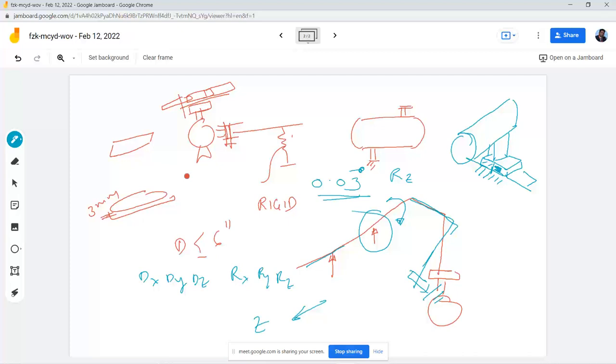In such cases, when you have this kind of alignment check trouble — for the W+C (weight plus content) plus H load case where a spring is involved — for this support you can make rz equal to zero, meaning rotations are not allowed. Once you stop rotations at these two points, you will see the entire pipe becomes straight. The fictitious answer given by the software — and this applies to all software like Caesar, ROHR2, AutoPIPE — is due to the beam element limitation. If you stop the rz movement, you will find the movement is hardly less than 2 mm.